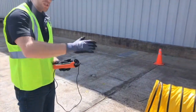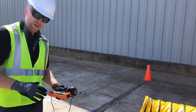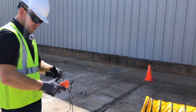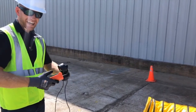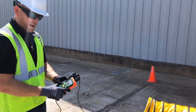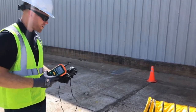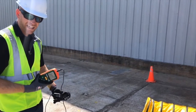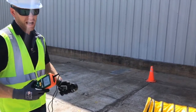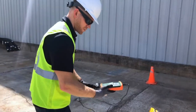You'll also notice that when using round duct in particular, there's kind of a vortex pattern of the air where just outside of the center point, we're going to get the highest airflow. That's typically where we're going to make our measurements. I'm going to show you how to use the anemometer, and then in later discussions we'll talk about how many measurements we should take and where to get a good average.